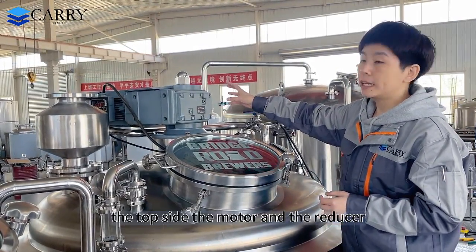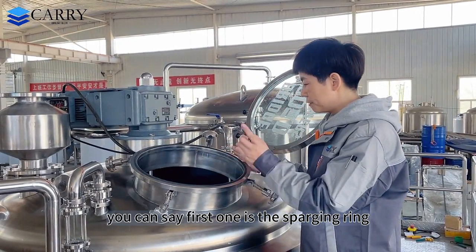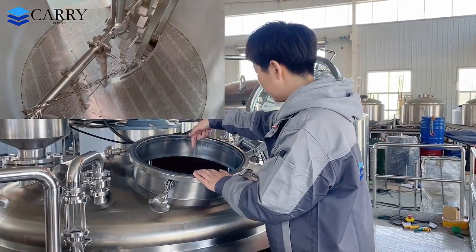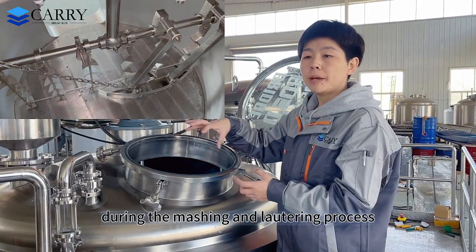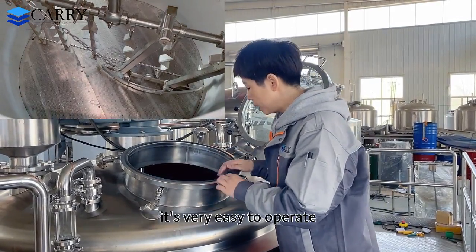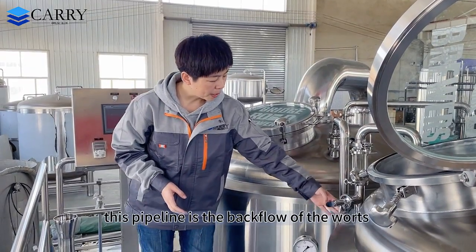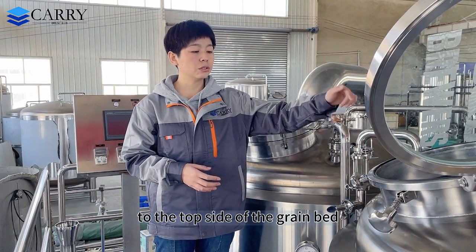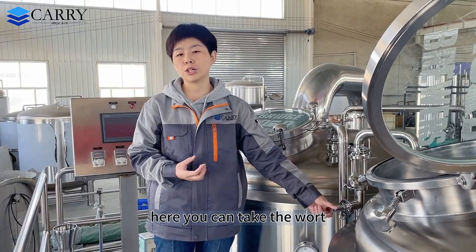This one is the grain breaker — the top side of the motor and reducer. You can have the grain breakers inside. Looking at the top of the mash tank, you can see the sparge arm — the hot water sparging very smoothly. You can see how the grain breaker is customized by our company — very heavy duty and does a great job during mashing and lautering. You also have the auto grain-out device, very easy to operate. During the lautering process, we will do the recirculation process — this pipeline is a recirculation of wort from underneath the false bottom plate coming to the top side of the grain bed. This one is a side glass, and also you have a sample valve so you can check the wort and test the sugar gravity.